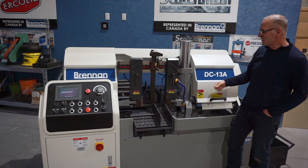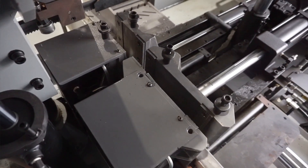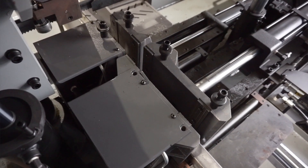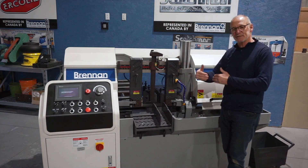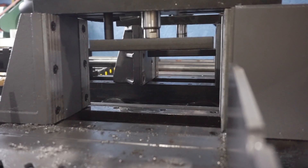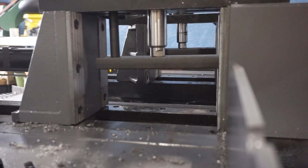This is a fully automatic saw. The shuttle on the back of the machine has a 19-inch stroke length and it can go up to 41 shuttles with a piece. It also has full-stroke vises on both the front and the back, so there's no setting your vises with a short stroke — this is a full stroke. The shuttle vise has bundling, and there's a bundling attachment for your front vise as well, all standard on the machine.